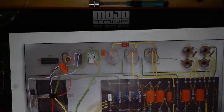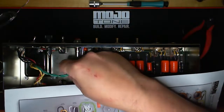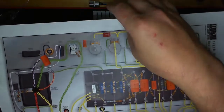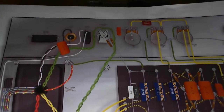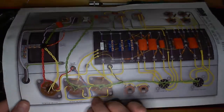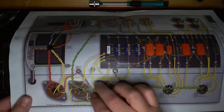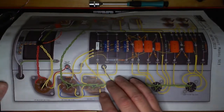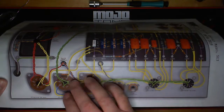Looking at the wiring diagram closely, the two green wires coming off the transformer are the same color — it doesn't matter which one goes where, as long as they aren't touching or shorting each other. What does matter is that coming off the actual pilot lamp you have two different color greens — a light green and a dark green. The reason for this is that when you run down to the first 6V6, these two tubes are going to operate in parallel for the filament heaters. The lighter color goes to pin 7 and the darker color goes to pin 2.